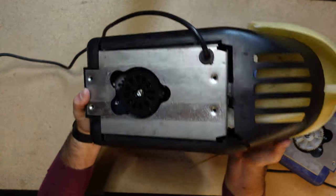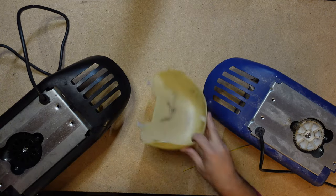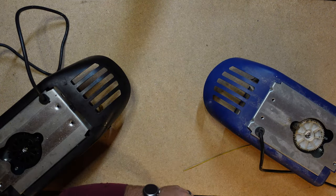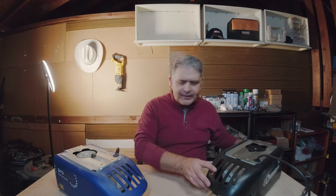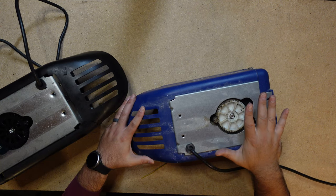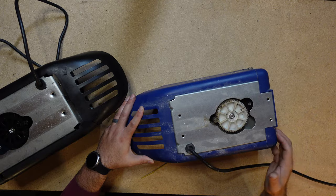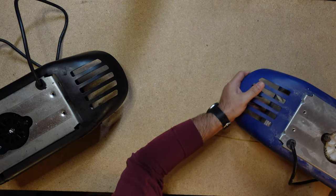They just didn't hold up very well. Look at how this thing is about to fall apart at the seams — it's heavy as all get out. Who wants a product that after several years just starts to break by itself? These motors had a relatively smart design and a pretty strong gear assembly, and I rarely found the need to repair them. But once the unit was done — once the logic boards or limit sensors went bad — that was it. You just had to chunk the thing. I replaced these motors time and time again because they're just not that good.